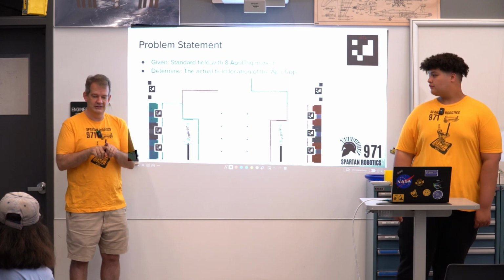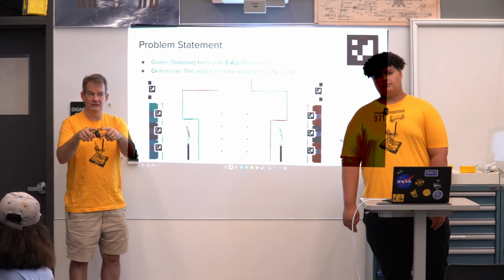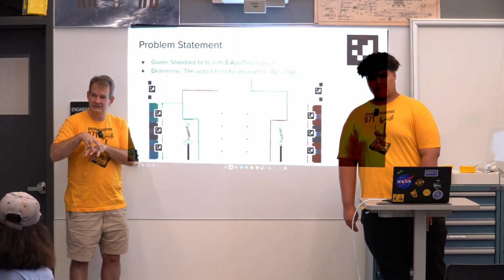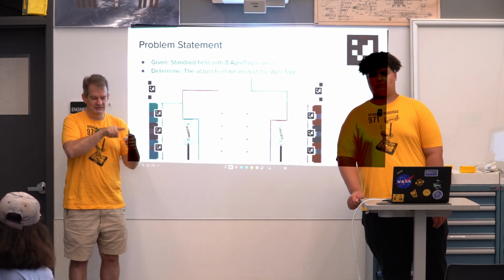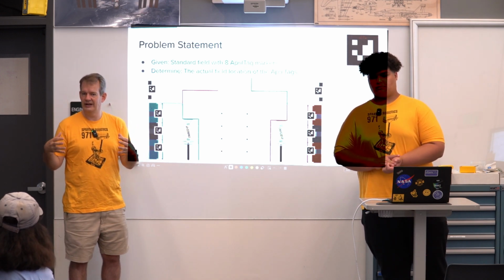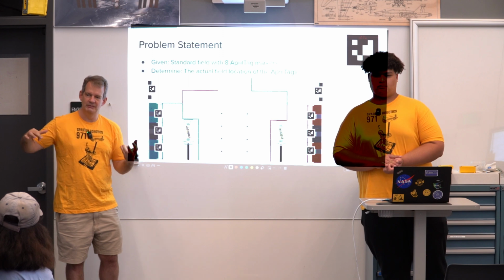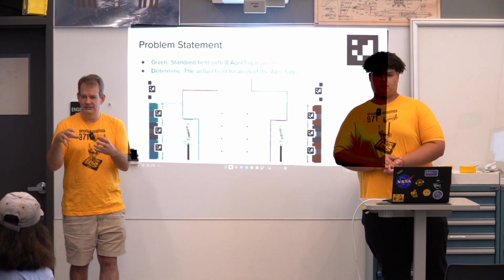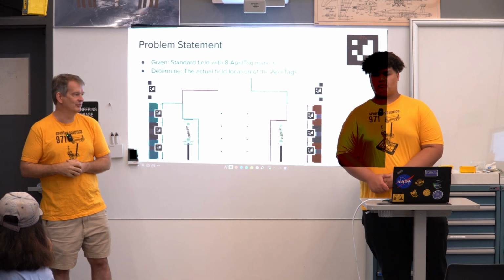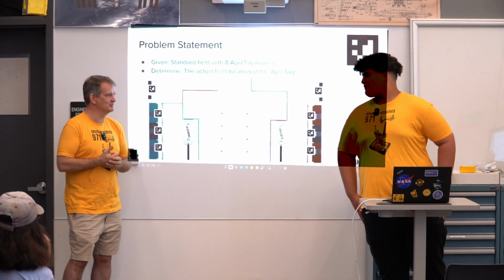The other thing you can do is see the same target with two different cameras, and if that doesn't give the same estimate of where the robot is, that probably means that the relationship between your two cameras is bad, so your extrinsics are having trouble. So you can split the problem into sections that way by observing on the field what's happening. That's probably a long-winded way to answer. I don't know if you've seen other things, but I don't think I have.